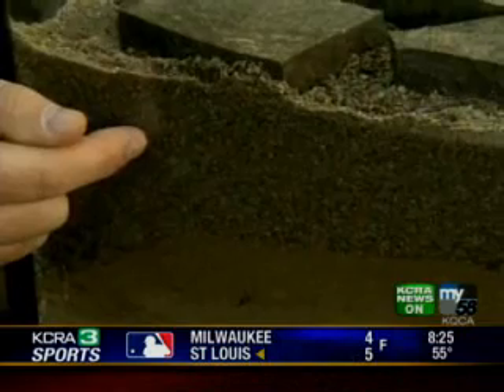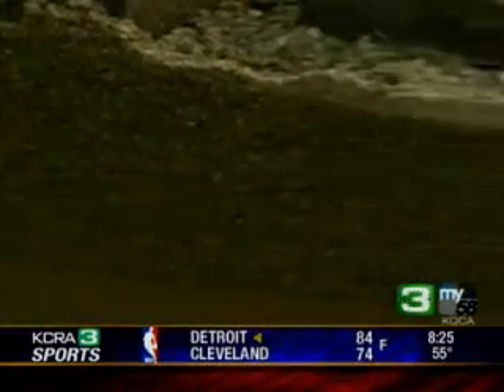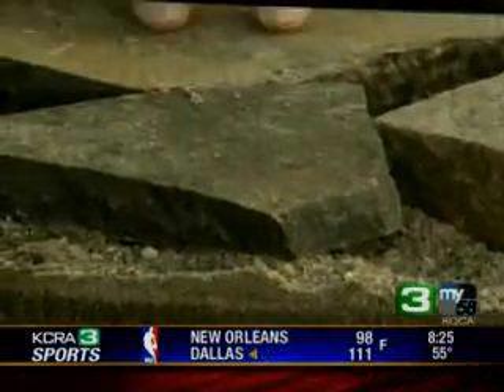Compact and grade it so that when water falls on your patio, it runs off. Then we're going to install a layer of bedding sand, which is the next layer. Then you're going to place your flagstone right on top of that.